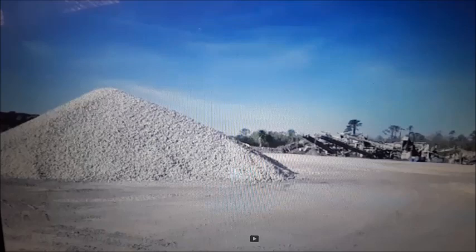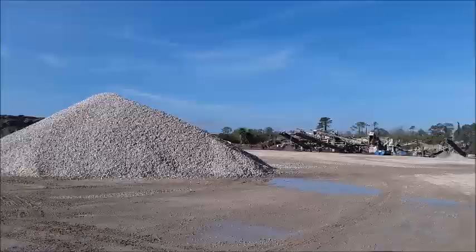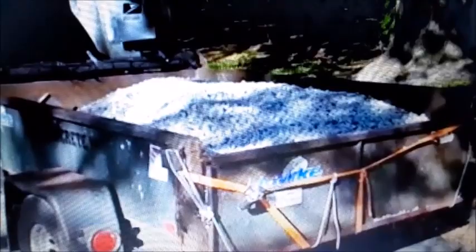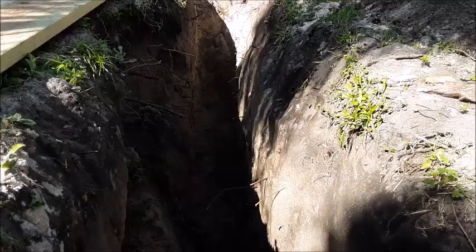Look in your local directory for recycling centers that sell recycled crushed concrete — this is the cheapest way to get gravel for your septic bed. They have a product called number four, which is about an inch to an inch and a quarter gravel — a good size to use in your drain field. They have scales to weigh your vehicle empty and full. This is our 5x8 dump trailer with a load of about 4,000 pounds. The trench we're working on is about 20 feet long and took two loads of this trailer, costing us about $120.